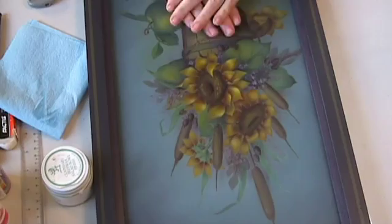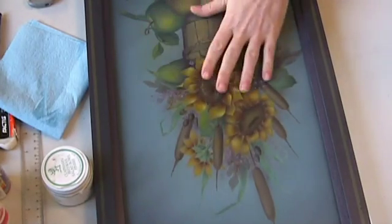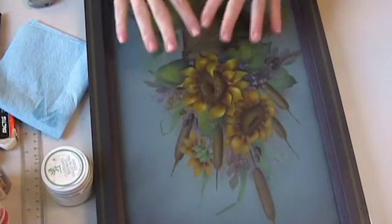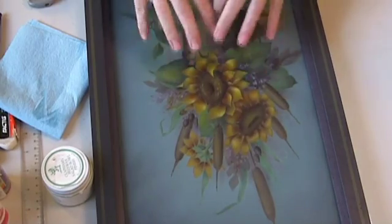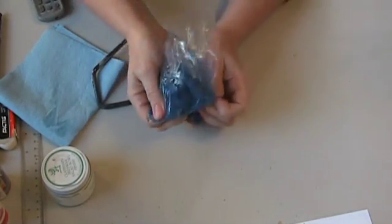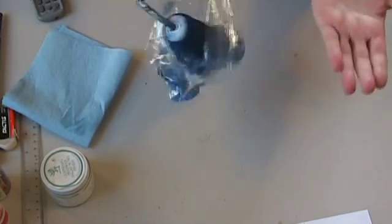Anyway, I was speaking just a few minutes ago about the difference in roughness of this board and the pumpkin board. What's really interesting is I rolled this surface with a roller, and the difference in how I rolled it is the secret to getting a really, really smooth texture. When you have rollers and you don't want to clean them out, take the heads off, put them in a baggie, and they will stay good for a long time. You can remount them and get a new baggie and restore it.